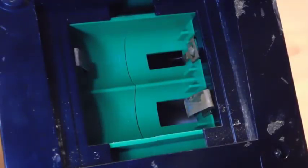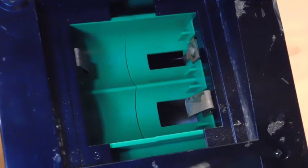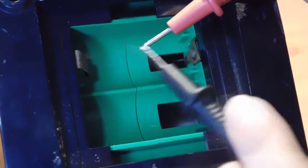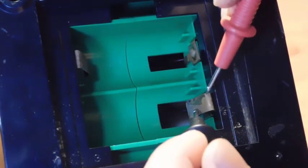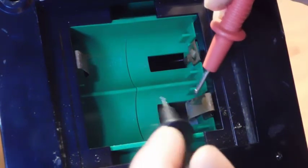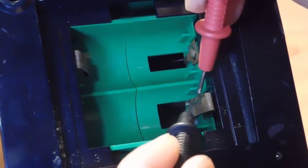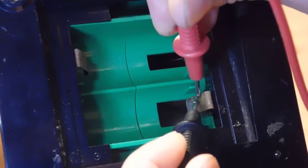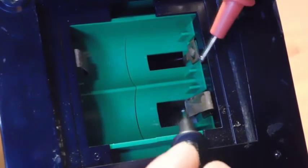I just want to give you guys a close-up of what the battery terminals look like — they have kind of a dull appearance. Battery terminals are supposed to be conductive. Right now I have the multimeter in continuity mode, which means that when I make a connection between two points there's going to be a beep, like that. But if I touch these sections here, there's nothing. My guess is that either some water or battery acid ate away at whatever nickel coating there used to be on these terminals. You can see there's still some left over in one spot, and if I touch that section I get kind of a crackle on the speaker — so there's some connection left there, but barely. I think that's our problem.